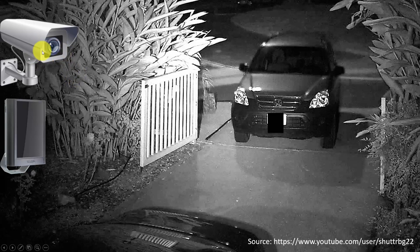Here's another example. You have a box camera pointing at a car, and you have a separate infrared illuminator that you can buy separately and install in different places. This device throws light onto the object and it bounces back to the camera. If you have ICR, it's much better — you remove the filter and the light comes directly to the camera.